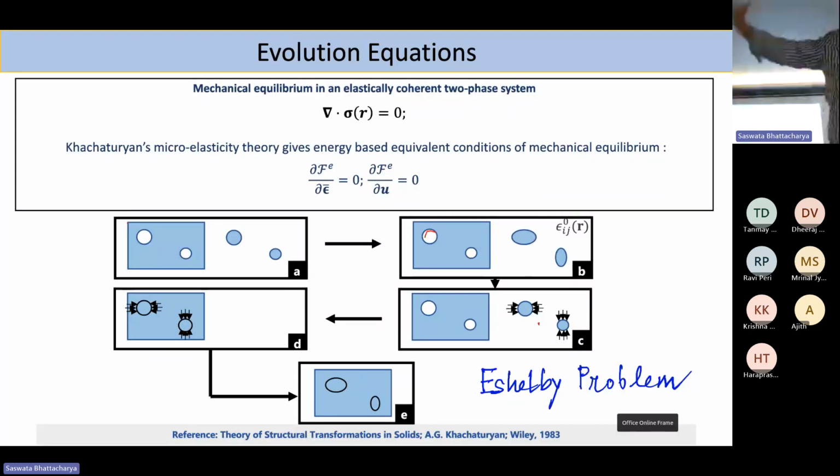So as a result, what we are solving here, please understand, I am not going into the detail of it. In fact, maybe I will use some recorded lectures where you can understand the detail. What we basically do is assume the displacements to be periodic. Many of the boundary conditions that I impose, because we are looking at microstructures, are periodic boundary conditions. That means I take one small representation, say for example this table, and I tell you this is repeating periodically.